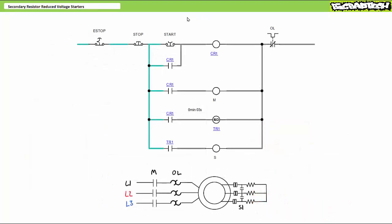Here's a real-time simulation of this circuit using Automation Studio. As illustrated in the walkthrough, an operator presses and releases start to close the M contactor, establish a holding circuit, and start the timer. Three seconds later, the timer reaches its count and closes the shunt contactor, shorting out the resistor bank. As anticipated, the motor starts in high resistance mode with high starting torque and less inrush. After a predetermined delay allowing a degree of time to accelerate, the shunt contactor shorts out the resistor bank and the motor switches to low resistance mode, suitable for high speed efficient operation.